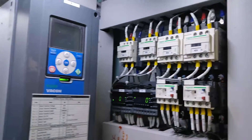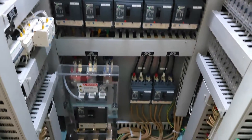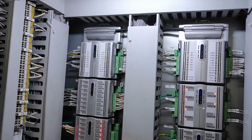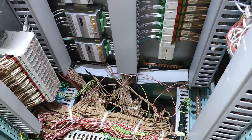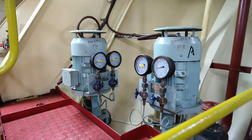This is the inside view of the control module. All the power panels — contactors and breakers — are present on the right side of this panel. You can see multiple breakers, and all 440V and 220V connections going to motors and different equipment are fed from there. On the left side, all the monitoring equipment are there, getting signals from your sensors, pressure switches, and flow meters, sensing all signals and feeding them to the SMCU.